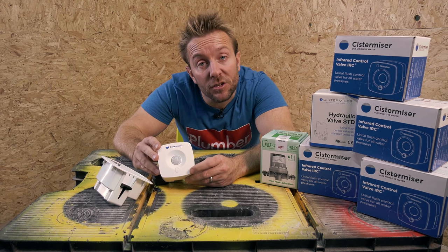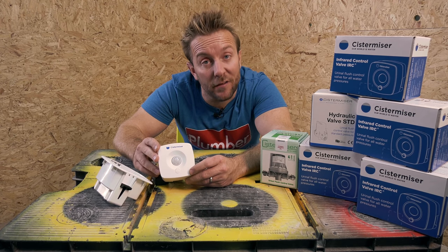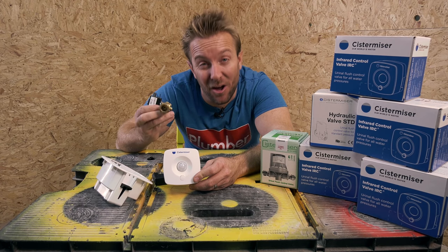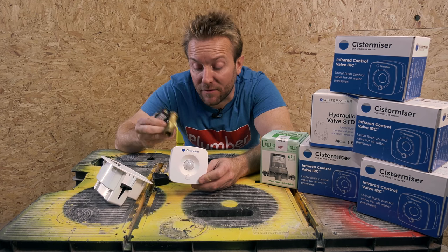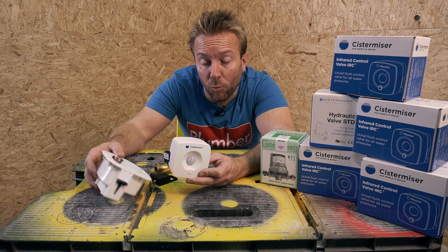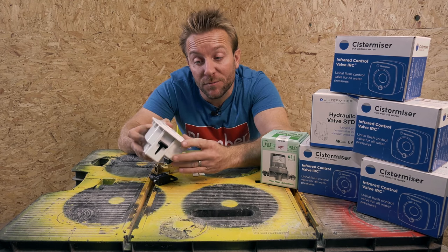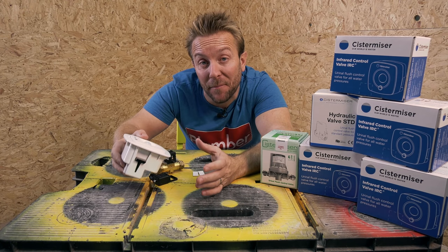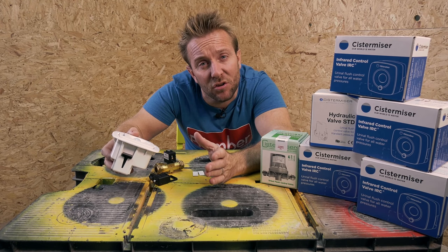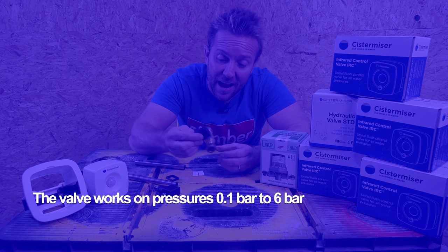So you're going to need to know about that when it comes to commissioning this at the end of the job. So the main reason you're going to be installing the IRC valve is because, number one, you want to save water. And these can save water consumption by up to 80%. That's loads. Think about how much money you're going to be saving there. Also, because it's a modern kind of design, especially if you have it wall mounted or ceiling mounted, it will be flush with the ceiling, which means if it is in a pub or in a place where people like to tamper with things, it's a lot more out of the way and they're much less likely to do that.